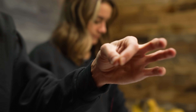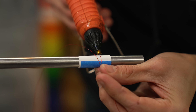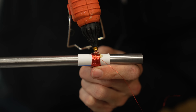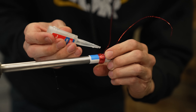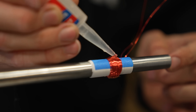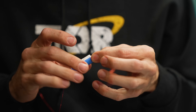I've given myself extra wire here, leaving several inches off to the side. I'm going to start wrapping and use a single dot of hot glue to hold the wire in place. We want to get probably at least 50, maybe 70 wraps around. I got a layer of hot glue to hold all the wire in place, but I'm also going to do a layer of super glue because the hot glue occasionally can come unstuck from the wires, whereas the super glue gets down in between them and holds better once it dries.